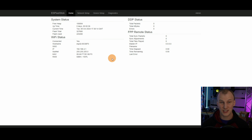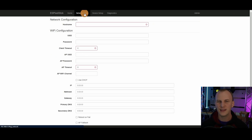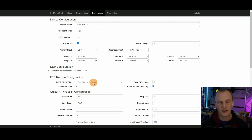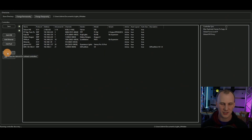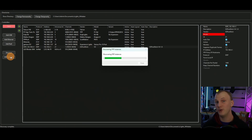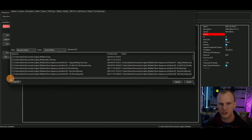Now we're looking at the ES Pixel Stick version — same controller, the Tetra2Go from RGB2Go, just running the ES Pixel Stick software. Once you get there, you have the ability to use it kind of as a regular controller inside of xLights. You set up your ports, set up your outputs, and configure the FPP remote configuration to play a remote sequence. It's going to follow sync packets for anything you put on an SD card in the unit. You can totally discover it as a controller and send stuff to it from FPP Connect — it's a full-on FPP remote.